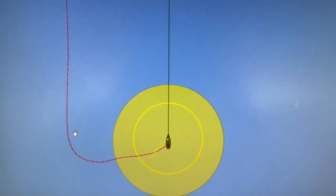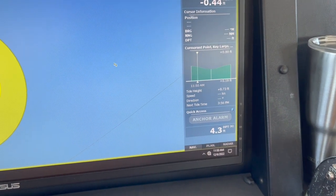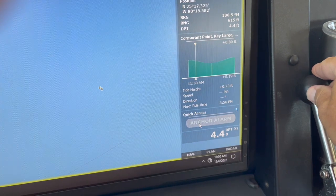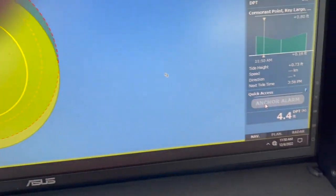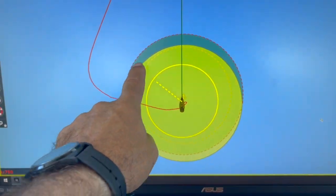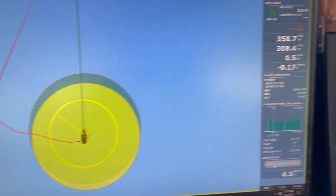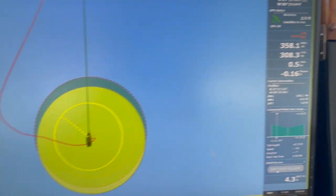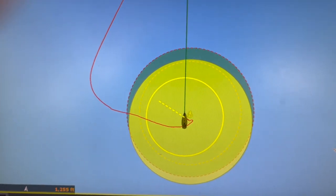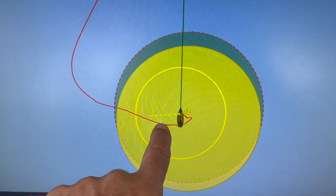Tracy will tell me as soon as the anchor hits. Tracy has just signaled we're drifting to starboard, so I counter-steer slightly. I put on the anchor alarm and can see where our anchor was dropped compared to where we wanted to drop it. We're going 0.4 knots backwards, but moving a little diagonally, so I put it into reverse to make sure the dotted line swings behind us.